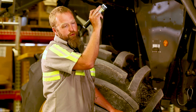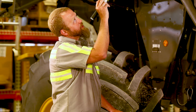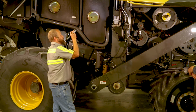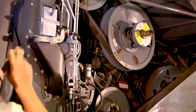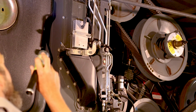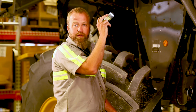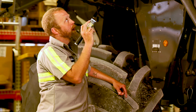Clean grain drive chain, it's up here, you can't hardly see it, but you want to look up there, and there's your idlers. Make sure your bearings are good in that. Loosen your chain, make sure there's no play in it. Your sprockets, if they're starting to cup, replace them. On most of my machines that I inspect, I replace it every year. It spins pretty fast, and it's not that big of a pain in the butt, but it'll cause you a lot of problems if something happens.